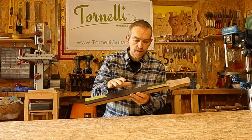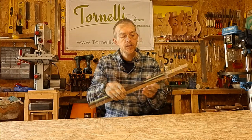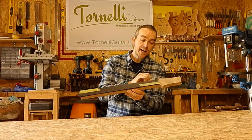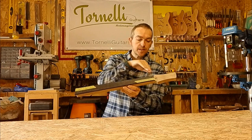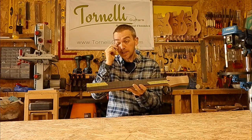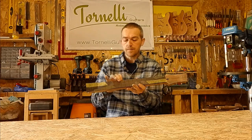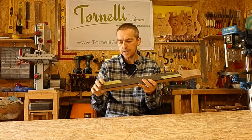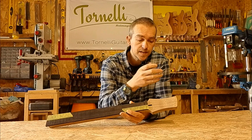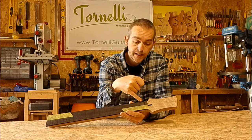The neck is at final dimensions and the fretboard is overhanging slightly — it's going to need flushing up. For this build I want to chat about proportions: the fretboard-to-neck thickness, the headstock thickness, and the fretboard length for the Fender-style transition. I have an overall thickness of 26mm — a 6mm fretboard and a 20mm neck blank — pretty much bang on Fender's dimensions. I make the headstock 15mm thick because most tuners are set up for 14–16mm.